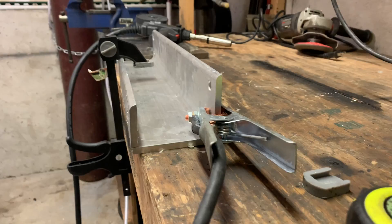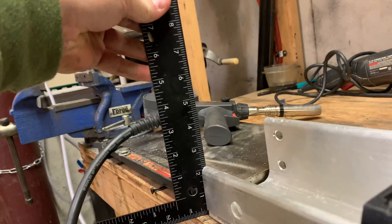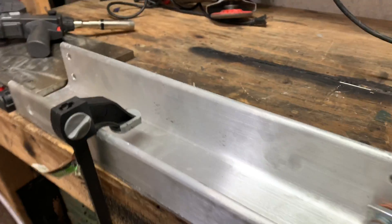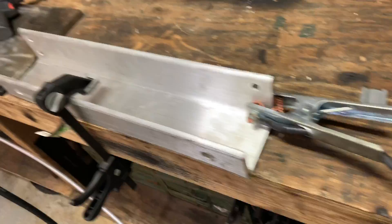The piece of aluminum is cut to where it will be two and a quarter inches tall whenever installed, or just shy of that so I can shim it up. Now I just got to weld this channel in, spot weld it here and there, and then cut it into the sections that will work for the motor mount.